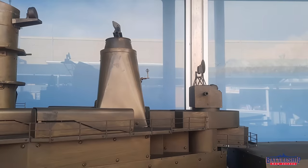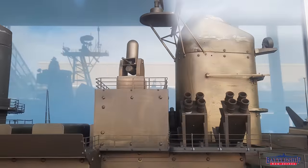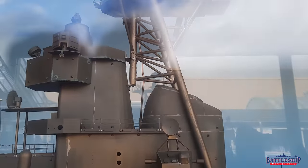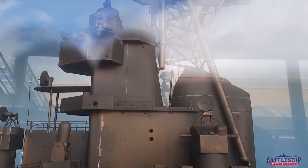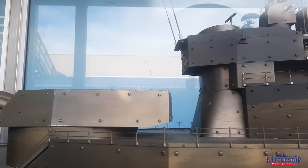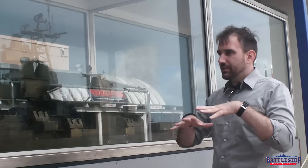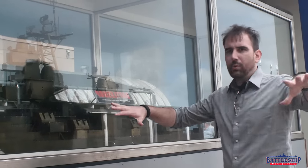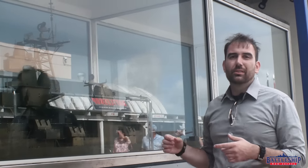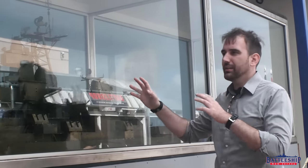Associated with the drones are a pair of antennas used to control them in flight. These were retrofitted in the mid-80s to the Iowa-class battleships. When the Navy retrofits antennas onto the ship, they have to make sure they're not going to get too much interference. So for the Iowa-class battleships and a number of other ship classes, the Navy makes 1:48-scale brass models. These can then be sat on a turntable that's 22 feet wide, turned to give several different profiles to basically a radar emitter, sitting on a bowl made out of lead that reflects signals similarly to water, so you can tell which antennas are going to interfere with each other.